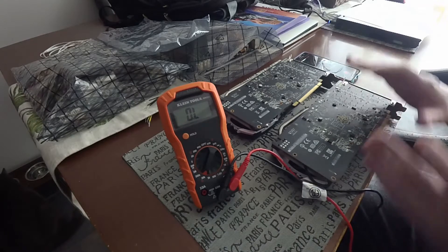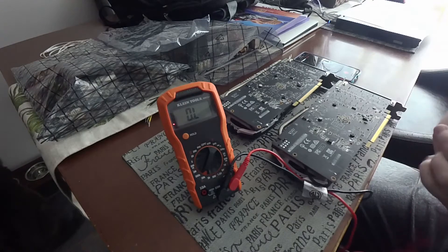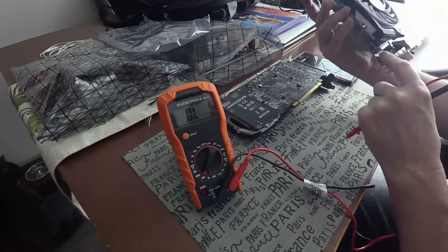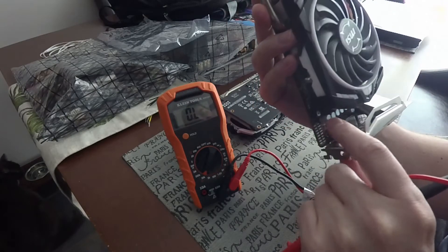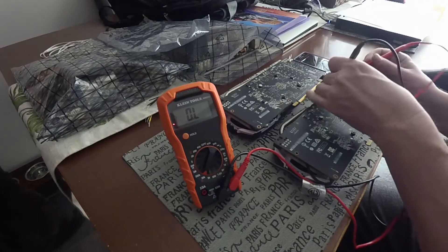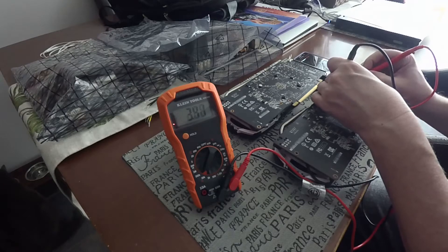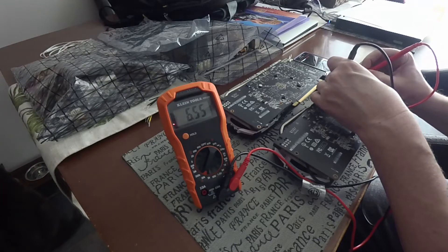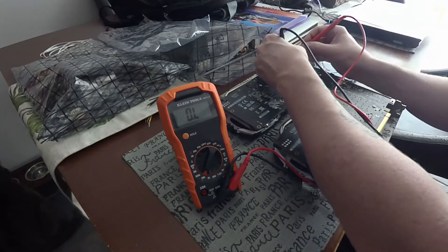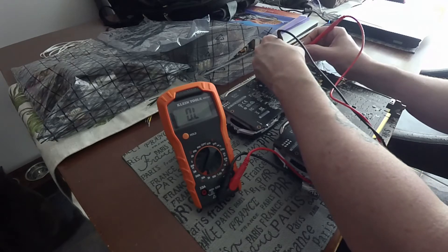Pretty much everything on that card is tied to the power rail. What I've kind of pinpointed is there are some capacitors up in here — there's a row of capacitors which stabilize and maintain the voltage on the card. If I compare this one, you can see it climbing on the meter. That power rail on the card looks good, and comparing it to the working card it does the same thing — resistance is there and increasing.